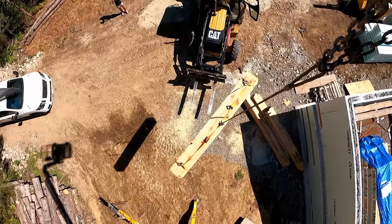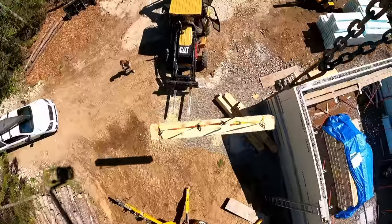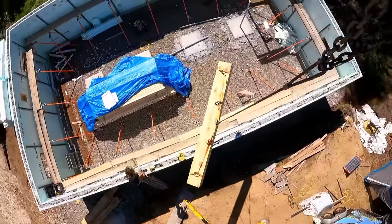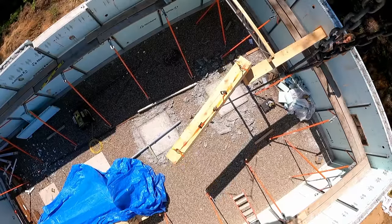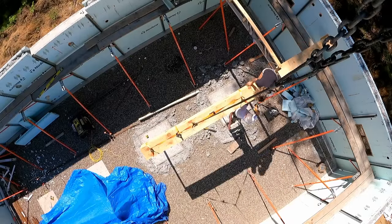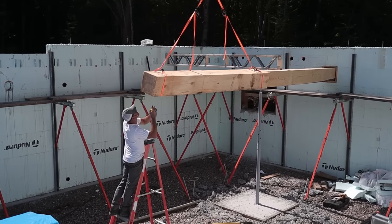Because I used to work construction in this area, I have a really good working relationship with the building official here. We were able to sit down, look at the plans, and when I expressed my desire to mill our own beams, we came up with the proper sizing. It is quite large, but because we are using our own wood, we have to go a little bit bigger than normal. So they are 12 inches wide, 12 inches tall, and the spans are 115 inches for the three on the inside. The two outside are about 120 inches because they actually slide into the walls and are supported by the concrete that we poured in.